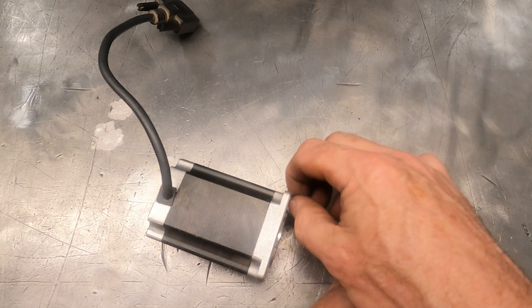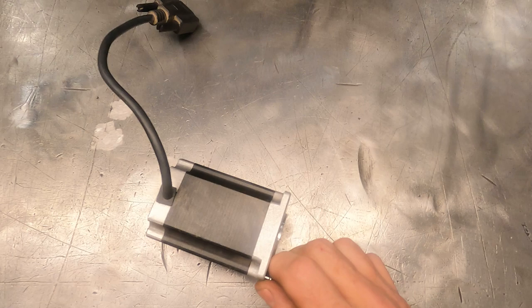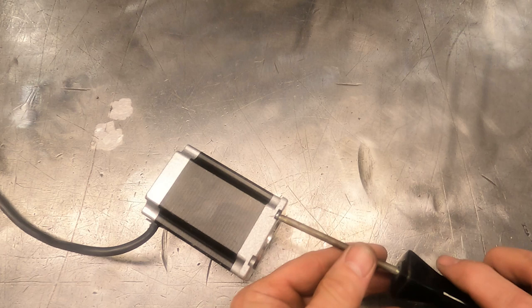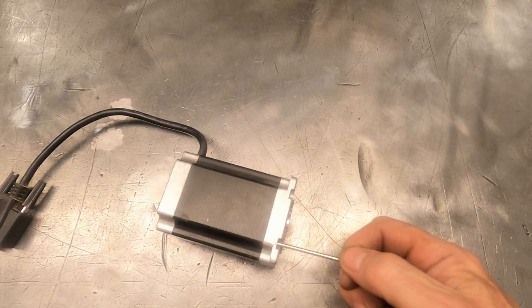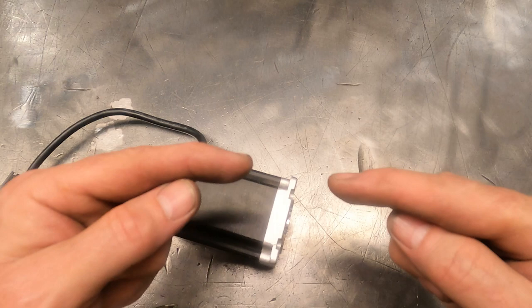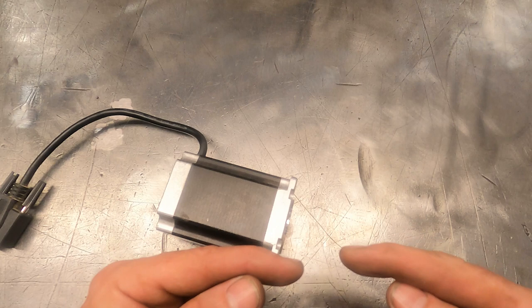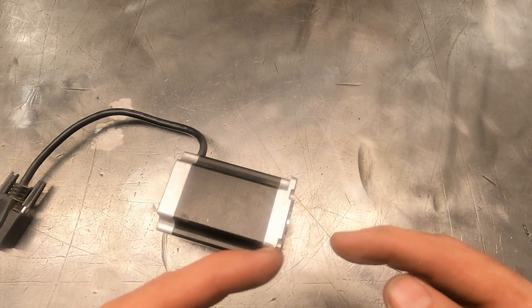While I'm taking these screws out - the difference between a stepper motor and a regular electric motor is that a stepper motor doesn't just spin when power is applied. Stepper motors have a series of windings that can control speed, direction, and even lock the motor in place. There are windings in two different coils - you can drive both in the same direction, opposite directions locks the motor. This one is 1.8 degrees per step, which is pretty standard. That allows the motor to position itself precisely in space through a motor controller.